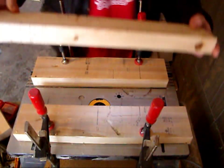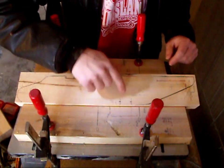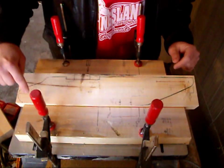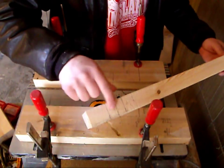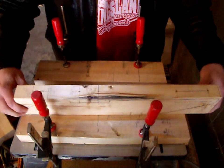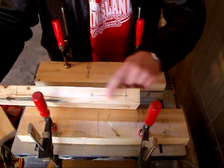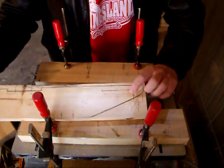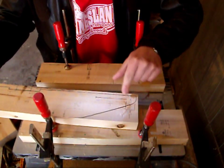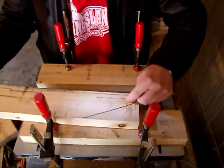Just a little rundown of where we are so far. We've got the airplane drawing out, we've got it marked out where we are going to drill the holes for the wheels, where we are going to route for the front wheel, where we are going to put the pegs for the wings, where we are going to route for the vertical stabilizer and the horizontal stabilizers. You can see we've come one inch from the edge, three inches long, and then an inch down.